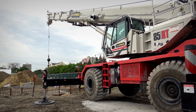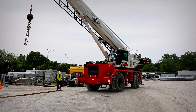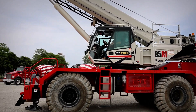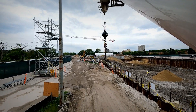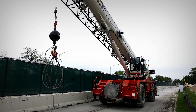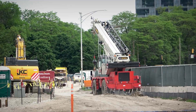The cameras have been fantastic. I love that winch camera. The backup camera, the counterweight camera — it really comes in nice. I'll actually drive and swing around a lot of times if I need to come out of a hole backwards, set up over the engine, and then when I come up into an area, I'll turn the crane one way while I'm swinging the other way to get the orientation the same. That backup camera and the counterweight camera help a lot, along with the side camera.